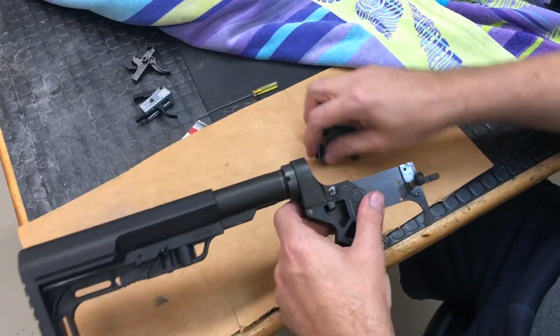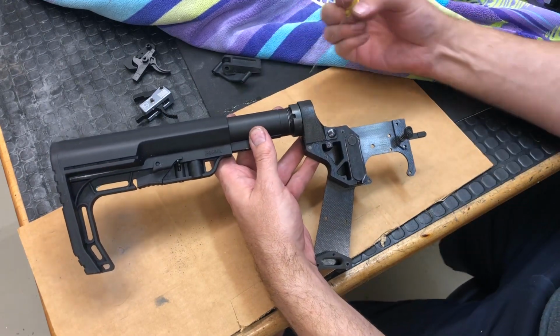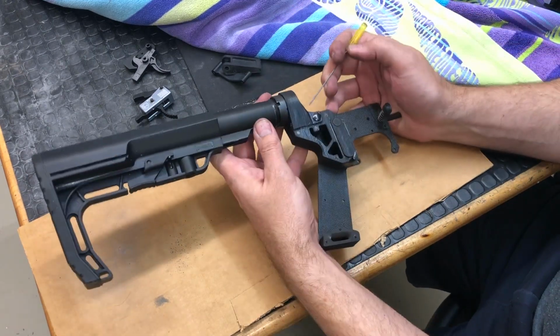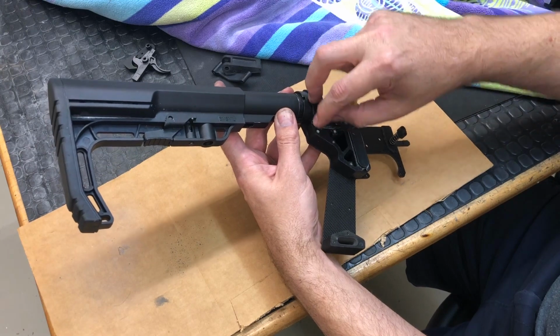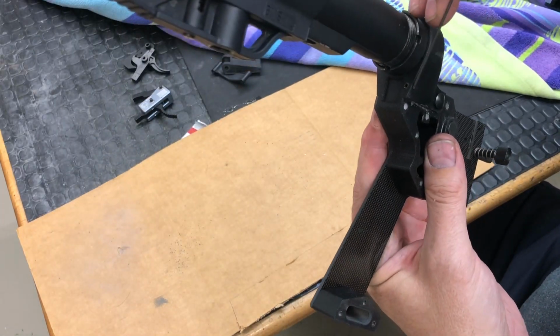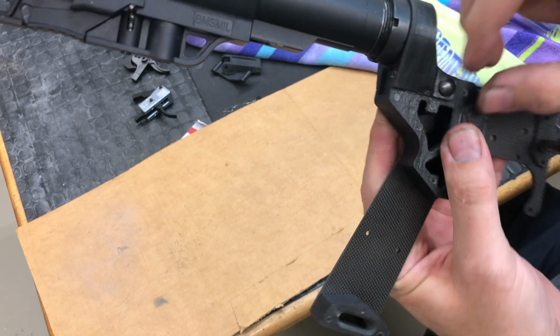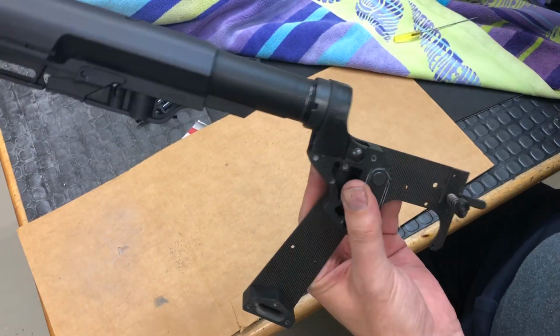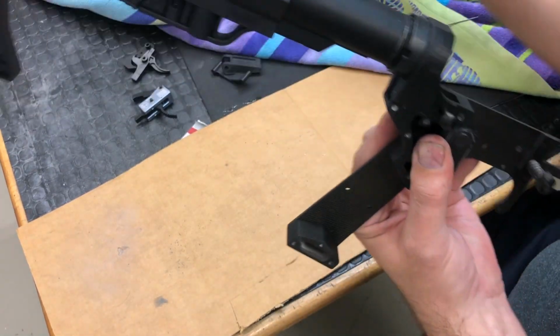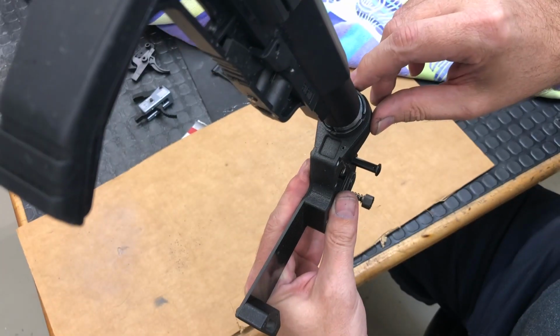And I accomplished that with a new embodiment here for the rear. What I did was I bulked up the piece here so that I could fit, it's going to be hard for you to see probably, but the spring rides in here and a detent for the takedown pin. And the takedown pin works just like it would work in a normal AR-15. And that spring is held in place with an M3 set screw.